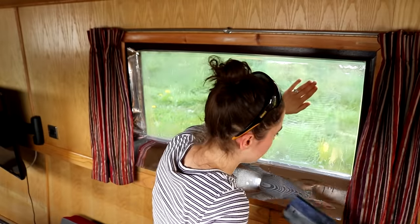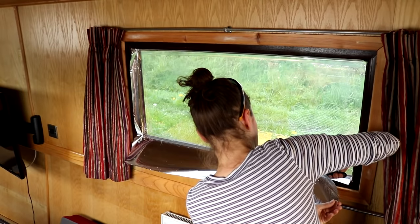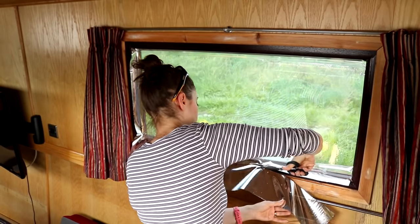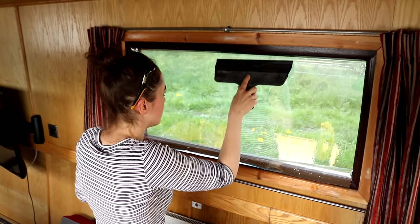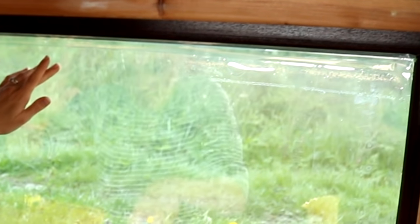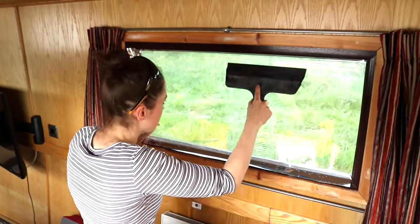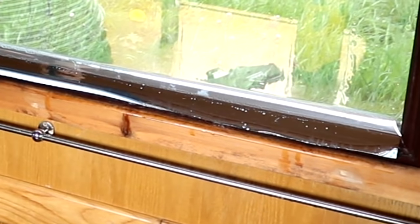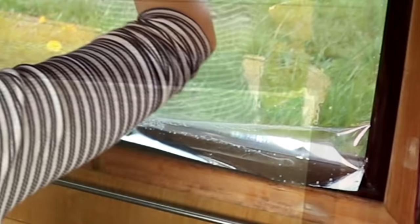The other thing about leaving a lot of allowance at the bottom — it just didn't feel a manageable size. So I quickly trimmed as much of the bottom off as I could. And although I didn't have a great deal left anymore, with even more continuous smoothing over, this is where it felt like I was going to be here all day, and it was going to drive me crazy. Especially having an allowance at the top, because the moisture just naturally wanted to run down. Whatever you do, do not have an allowance at the top. The other thing I found was that even leaving an allowance around created an overlap around the beading, which then created an air gap — so even though moisture would come out, air would go back in and I'd get large bubbles in the corner.